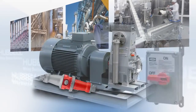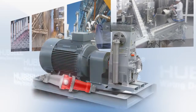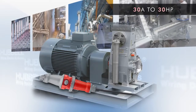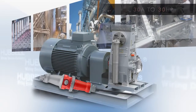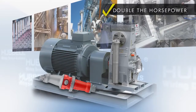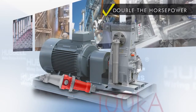This means they're approved for both motor and branch circuit disconnects. The Advantage Series has increased the maximum horsepower rating of a 30-amp switched connector to 30 horsepower — a new industry benchmark, doubling the previous. In addition, it has a short-circuit current rating of 100 kA when used with a Class G fuse.